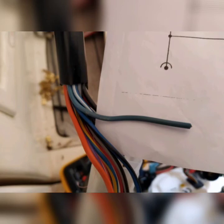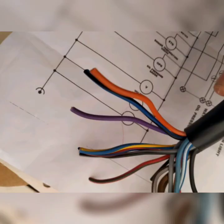We had an issue when we fired the whole thing up with the tachometer. The tachometer wasn't working. Volvo Penta told us that the tachometer wire was a grey wire, a solid grey wire. That was what was on the wiring diagram. When we fired it up, it didn't work, and trial and error told us that what we were looking for was a grey and white wire in the loom. This was located using the internet. Basically, we looked for a newer Volvo Penta wiring diagram that gave us the information that it was going to be a grey-white wire.